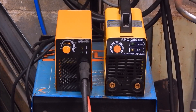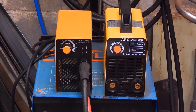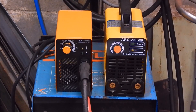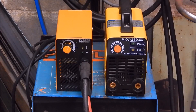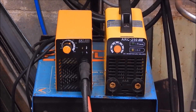The only way to really check it out is to run a whole bunch of 3.2mm rods through it and see what happens. Looking at the duty cycle, it should basically not last more than about half a minute. So that's what we're going to do today — run some 3.2mm rods through it at 130 amps and time it. The air temperature is 18 degrees C, which is 64 degrees Fahrenheit. For duty cycle testing you'd normally test at 70°F, but it's the middle of winter and this is the last dry day I'll get before it rains for a week, so we're going with 64°F. It's a typical autumn day and I think it'll still be representative of what to expect.